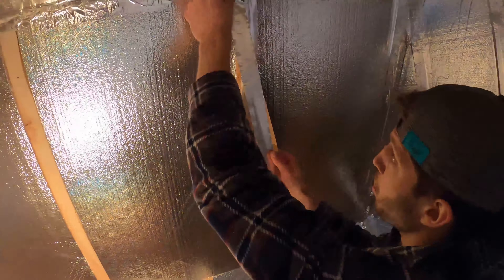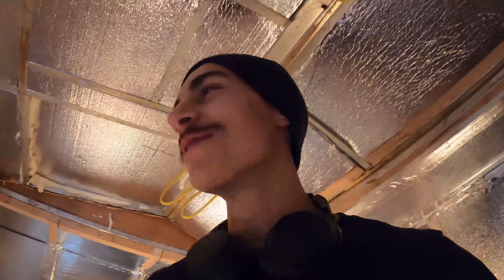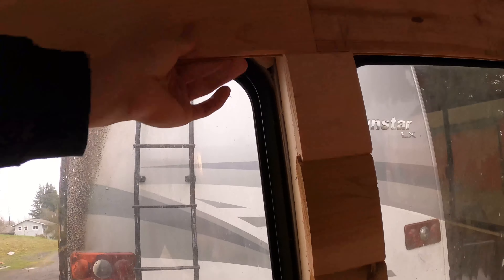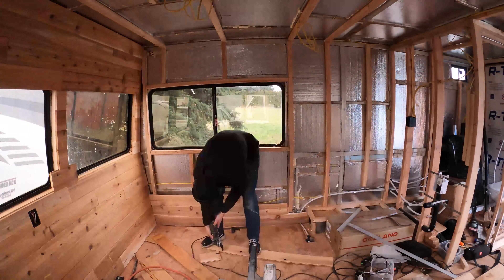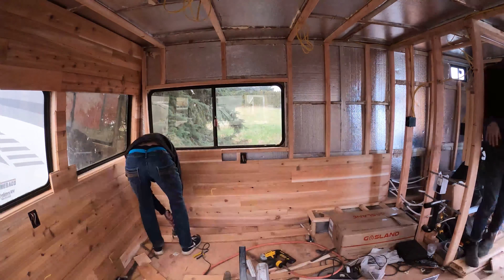Max is back — finishing up sealing all this stuff. Just finished the first wall fully, it's all nice and done. The reason there's extras on the corners and at the top corners is because I'm not 100% sure how I want to finish it yet, so I want to leave extra versus cutting off too much and having it look bad. I'll finish those off at the very end once I'm done with all the tongue and groove. Next up is this wall.